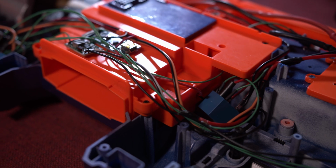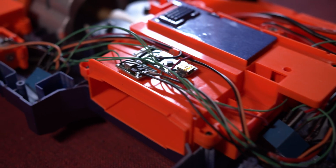But for the pusher and the barrel rotation, they both require PWM and motor braking in order to get as precise control over them as you need. I did this by running them through both a relay and a MOSFET. The relay handled switching it on or into brake mode, and the MOSFET handled pulse width modulation.